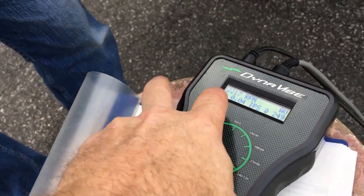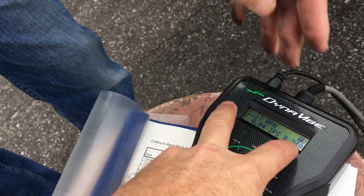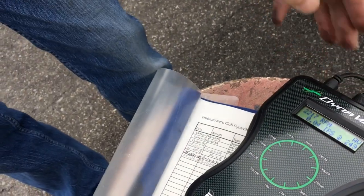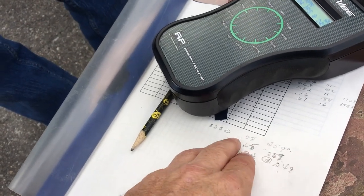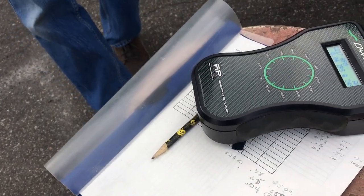And this is, I'm going to say, the off balance at the reciprocal of that. So the 180 degrees off of 249 is where you'd add the weight. The problem is at 249. When we started, it was 0.78 at 259, and then you just slowly add weight, 180 degrees off. Always.